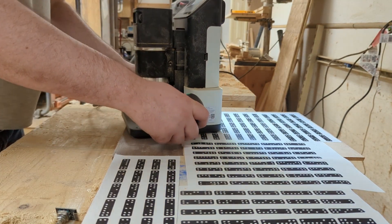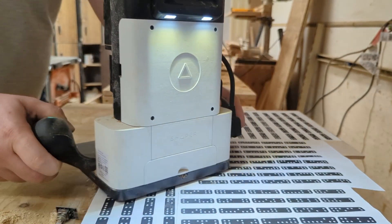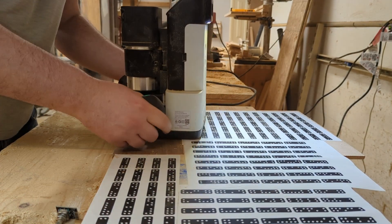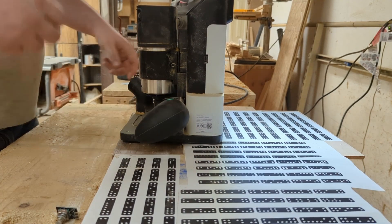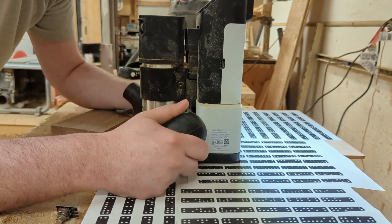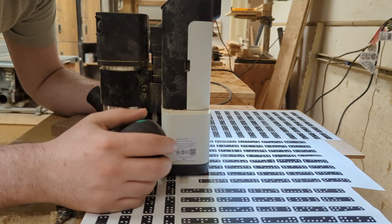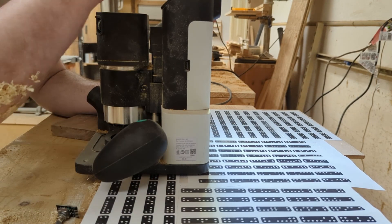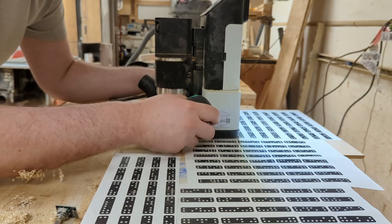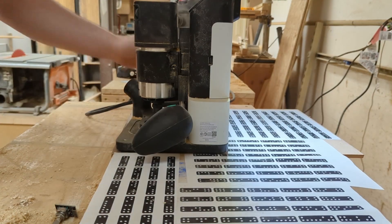The first thing I've got to do is scan the work surface, done by just moving it everywhere. I'm not going to show you the full scanning process. After that, we can go through and make a grid, which makes it so we can align things to the square appropriately. What I mean is if we have a part on the front and a part on the back, we need to align it in X, Y, and also in twist — because if it's not twisted correctly, it'll cut on the wrong spot. You do this by taking three points with the spindle.